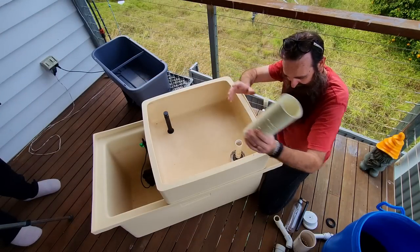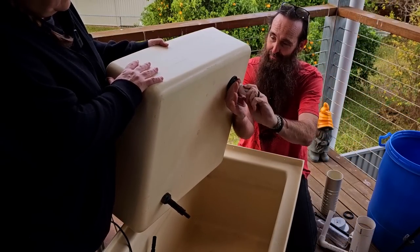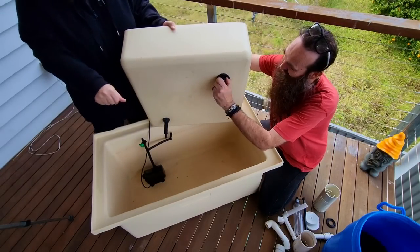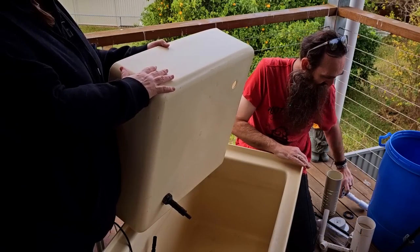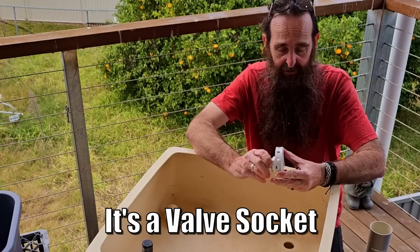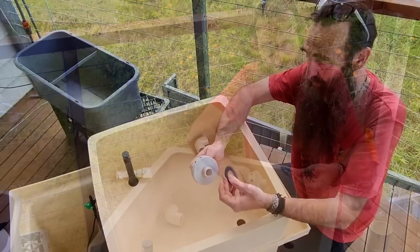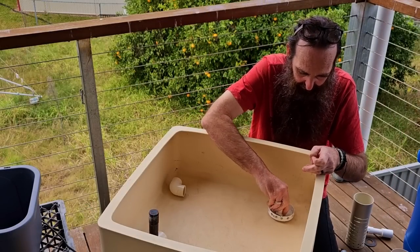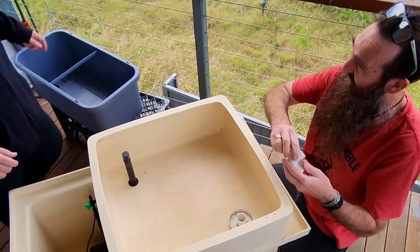Now I suppose what we should do is take this little doohickey out first. If my lovely assistant Bianca could help me — thank you very much Bianca. So I just take these out. Taking this little tank or bulkhead fitting off and I will be replacing it with an o-ring on a valve or faucet socket — I mix the two up all the time — and that goes on the inside of our little base plate here. Screw that in nice and firm and then pop the little washer on. Make sure that's seated nicely, then place that down through the hole in the floor, and then underneath we'll grab our 90 degree elbow. That will just screw on underneath and those washers on the top will create the watertight seal. We have a simple one inch pipe that we can just push in there, and that will direct the water down with that little 45 degree fitting onto the water surface itself.